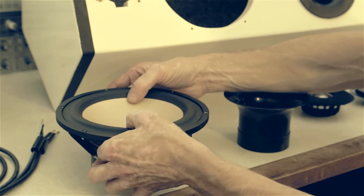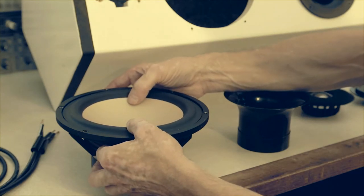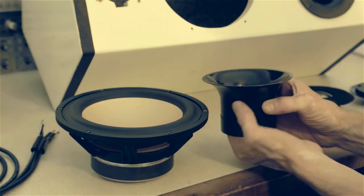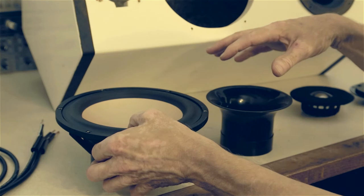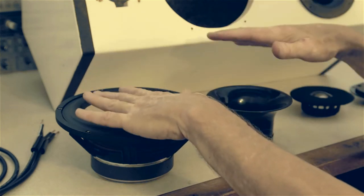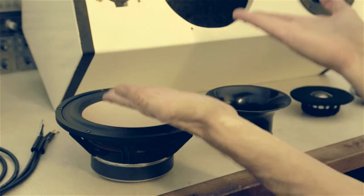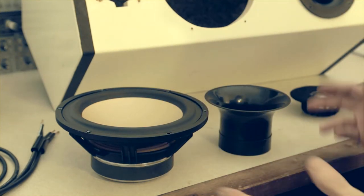So producing these positive and negative waves will produce opposite waves inside the cabinet. As I produce a negative wave in the environment, it's producing a positive wave inside the cabinet. That positive wave will come through the port and out into the listening area. So as a driver is trying to produce a negative wave, you're going to be producing consequently a positive wave at the same time out into the listening area — and those two waves, positive from the vent and negative from the driver, will cancel each other out. And conversely, when it creates a positive wave, it'll produce a negative wave at the vent. That wouldn't happen at all frequencies, but at some frequencies it could potentially happen.